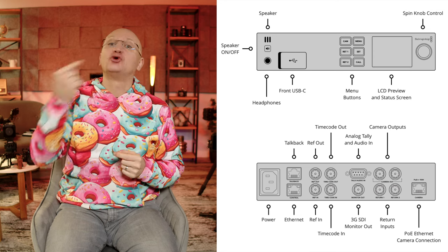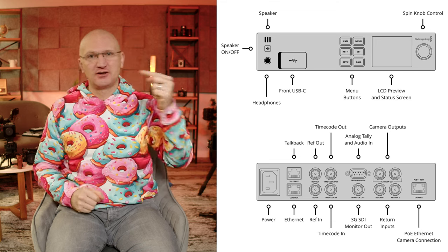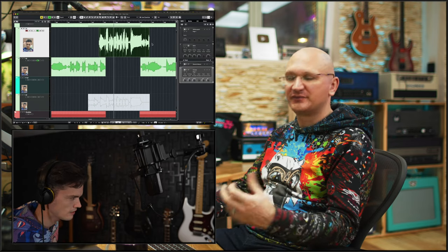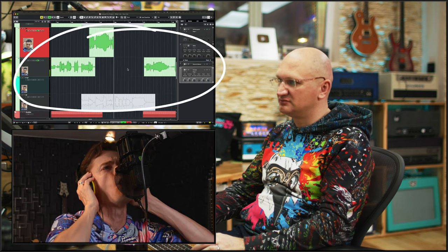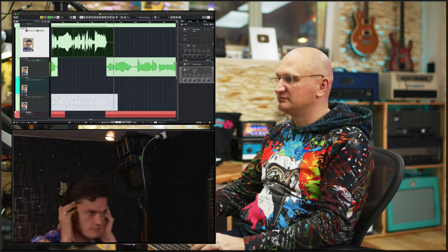It runs 4K to the switcher. It runs control signal to the camera, and it has to be getting a program signal from the switcher. So that's all plugged into the back of that studio converter. But it actually also has a second video signal going into it. And that second video signal is also through the Ethernet cable going into the camera, and that can be taken out of the HDMI out. Something that we did, for example, a vocalist was upstairs, we were recording vocals, and I wanted to record him with the camera, and he needed to see the recording software to see what we were doing. And I was actually running a screen capture from the Mac into the switching system, into the studio converter, into that second input, and I had a screen connected with HDMI to the output of that camera showing the recording software at any given point in time.